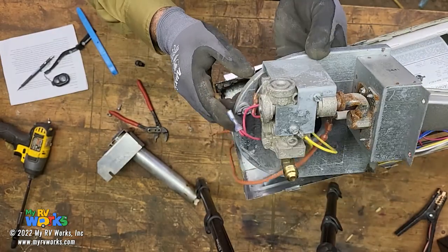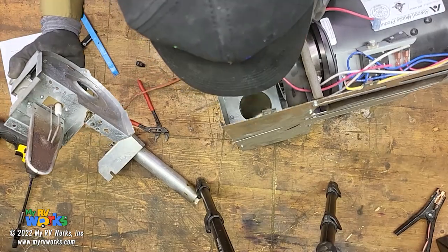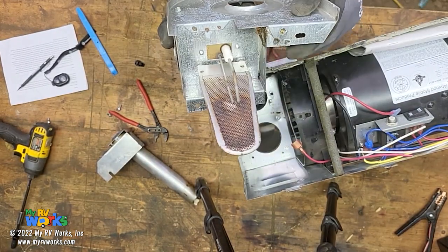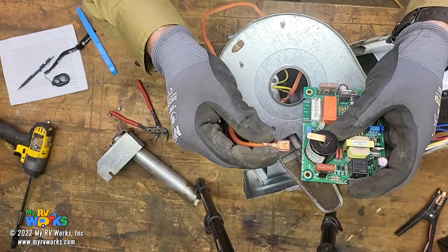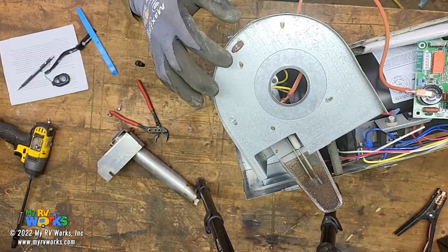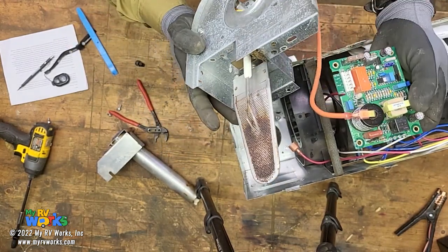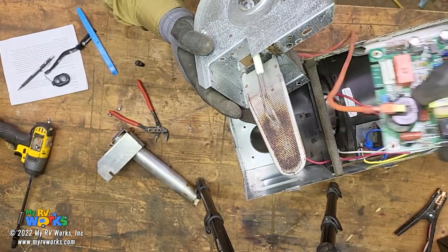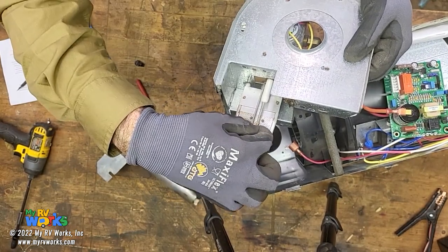Robert, when I was reading your question, you were talking about having to take the solenoid off. You really don't take the solenoid off. You just take these four screws off - here's your little plate right there. Then you look in there and what you're looking for is about an eighth-of-an-inch gap between the two prongs and also underneath the burner head. With this loose, you can plug everything back in the way it's supposed to be and try to start your furnace. You should see little lightning bolts - little sparks - right here at the electrode. Remember the first test where you held the wire off and looked for a spark? Well if it's sparking there, it should also be sparking here. But if it's sparking at the wire but not here, feel this electrode that goes into the ceramic and see if it's loose - I've done a video where we found the electrode loose inside the ceramic.